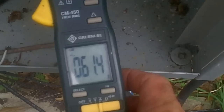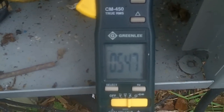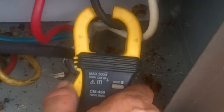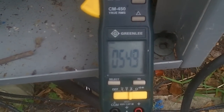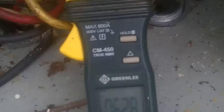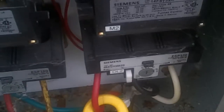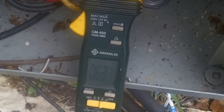Amps aren't too bad right now — well, they're going up. Okay, let's go back to leg number one. See how leg number one's pulling high? That's pretty much telling me that the contacts are dirty inside, so I'm going to pull it apart and clean the contacts.